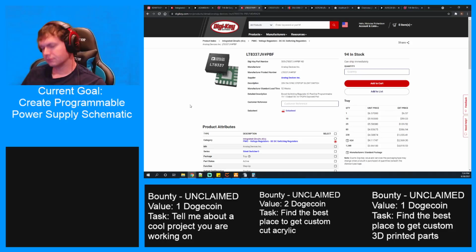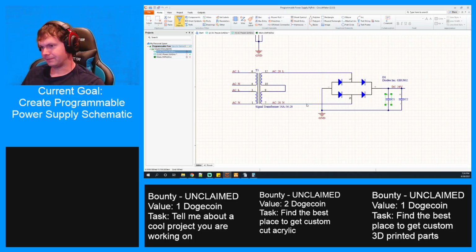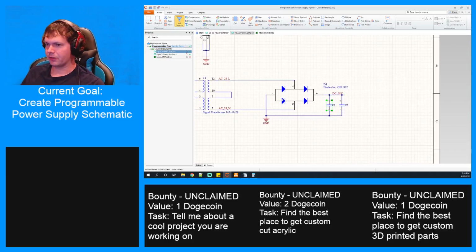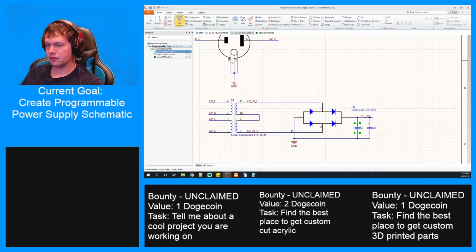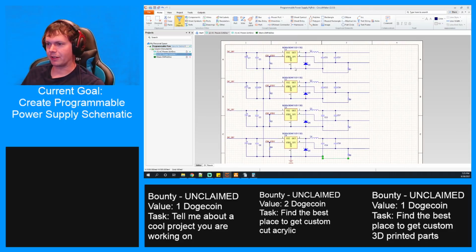If this doesn't work, I'll probably need a new transformer. Because if we drop down to 12 volts, there's no point in getting the 28 volt transformer. It's too much. It would work, probably, but we're spending more money than we need to. Those diodes are fine, we're only getting one diode. Input AC would be fine still. Going with something smaller, we might be able to get more current out of it, though. That'd be kind of cool. We would need new regulators, because there's no point in paying for this one if we're going to be able to get something smaller.